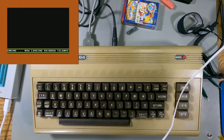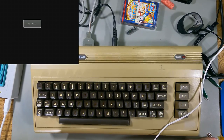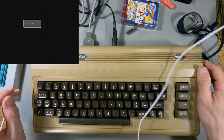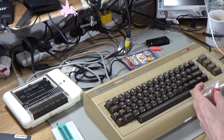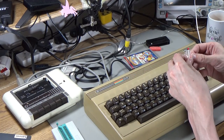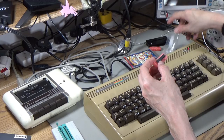That's not working. I just turned the sound up - I wasn't listening to the sound. That has not worked. I wonder if there's still a problem with this Commodore 64 because I know for a fact this tape works and on that tape drive it works too. That's really odd. There's probably another problem with this Commodore 64. I'm going to reprogram the right GAL PLA as well - I know this tape works and I know it works on this tape drive and on a different Commodore 64. So I'm suspecting maybe something's wrong with that right PLA as well.